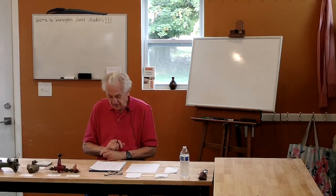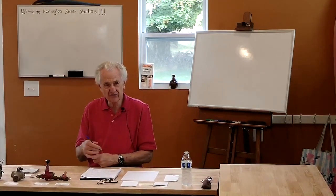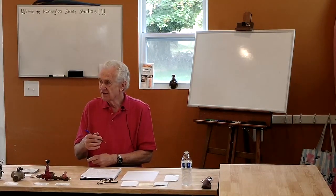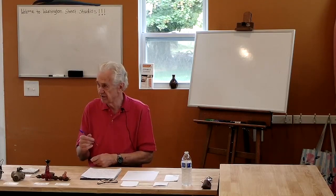And where it's used in residences, it's used at very low pressures. This is an important thing we'll talk about more. Because for safety reasons, they don't want to be supplying gas at high pressures to a house. Because if you had a leak, too much gas could escape before the leak was even detected, and you could have potential explosion or fire problems. So it's supplied typically at around a quarter of a PSI. That's a quarter of a pound per square inch. Gas pressures are measured in pounds per square inch. And typical natural gas to the house is a quarter of a PSI.